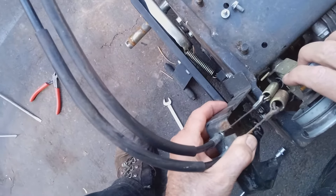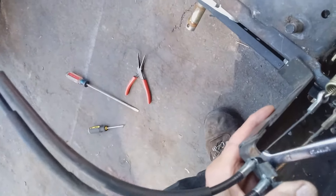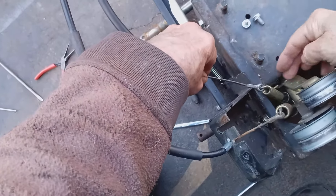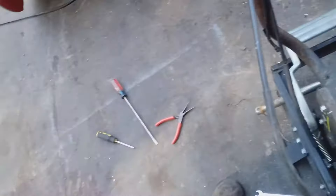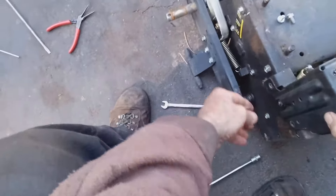Now you can see what we're talking about here. You see how the cable is attached — this is the drive spring, this is the auger spring. It's held in by a lock nut, so I want to loosen the lock nut. Now it's loose. I want to keep tension on it. The trick is to keep tension on it so that the bottom of the spring doesn't fall off the tensioner. So I'll just pull it out, then put the new cable on just as I took the old cable off. I slide it on, keep the tension on it, slide this in here, and tighten it up. Once you've tightened it up, you can line up your bolt holes, start your bolts, and tighten them up.